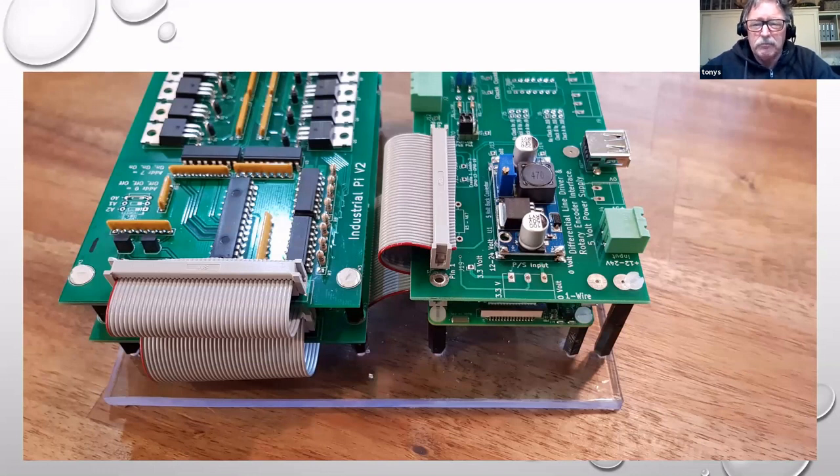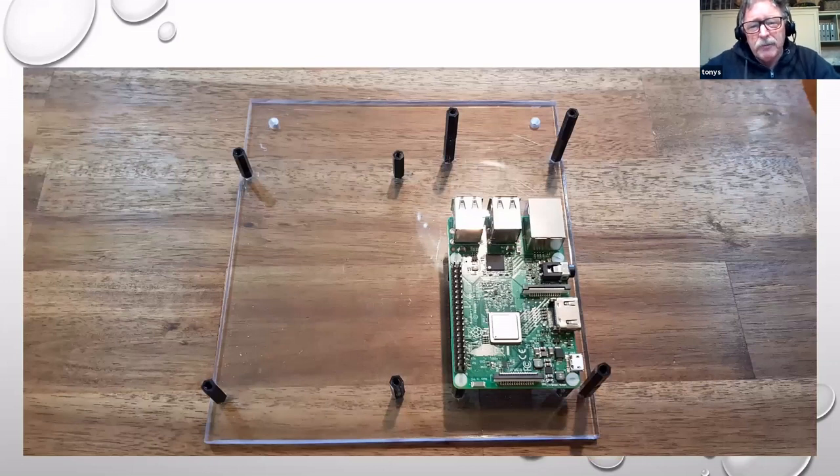The systems I find are just highly reliable. The concept with these I/O boards is the 24-volt power supply that runs the whole system is current-limited to about three or five amps, and the MOSFETs are rated way in excess of that. So you can put a dead short on the output and all that happens is the power supply current limits and pulls the voltage down to zero - there's no need for fuses or any protection, just using the current limit on the power supply. What I've done is taken a piece of six-millimeter acrylic, drilled and tapped holes into it, and put in standoffs screwed straight into the base.